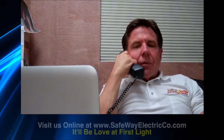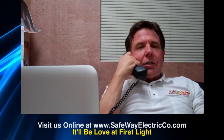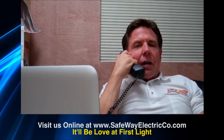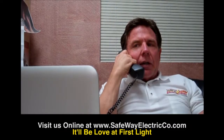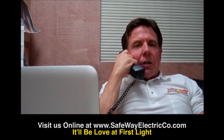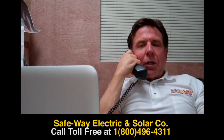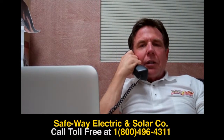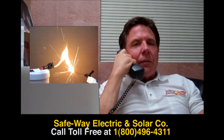That's just what it is. There's a lot of poor workmanship out there that has caused series arcing over the years and created a lot of house fires. Usually the poor workmanship is underneath some type of connection, whether it be underneath a wire nut or underneath a screw connection. Some of those receptacles and light switches are wired under spring tension, and what happens is there's heat and electricity — that spring becomes weak after a period of time and creates a loose connection.